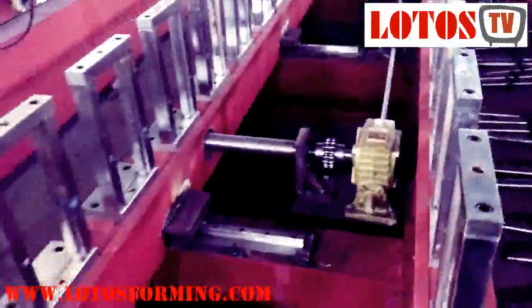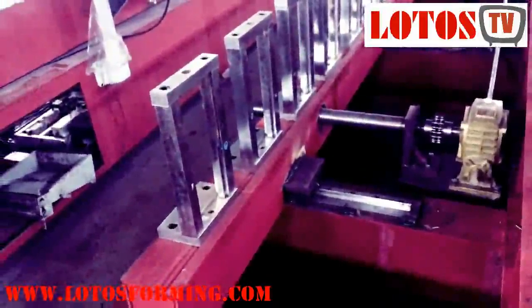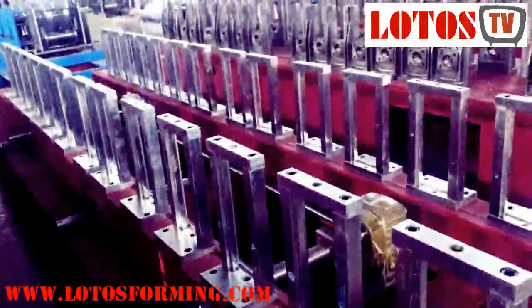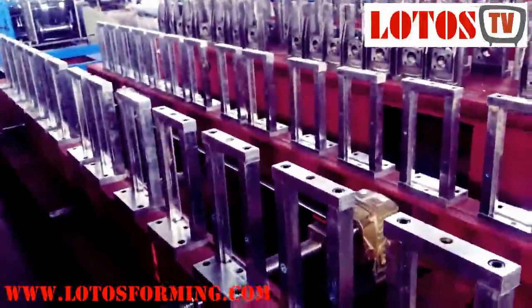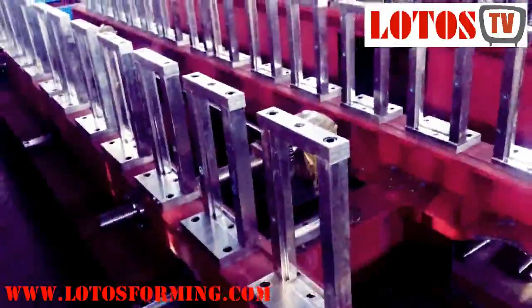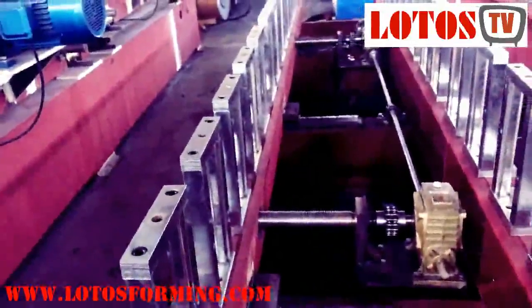Here is the complete steel pillar that I just showed you — it is already assembled here. As I already explained, one side of the roller stand can move by these gears; the other side gears are right here, connected with an arm. So for various width profiles, we use this kind of adjustable station base — it can move left and right by PLC control.